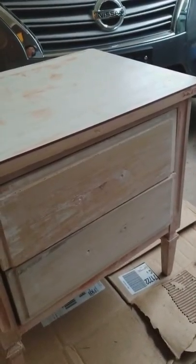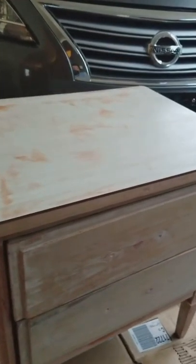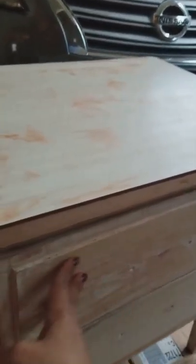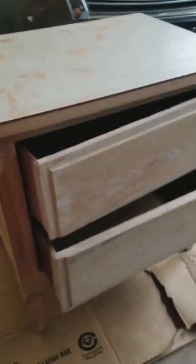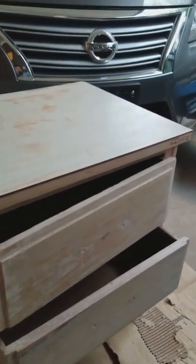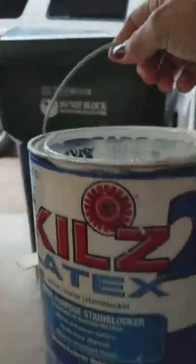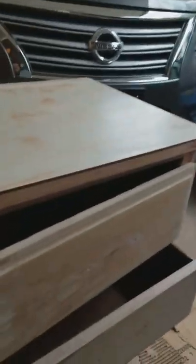This is my cabinet and it's all clean sanded now. I went ahead and did the drawers and they're completely clean sanded down. I washed it down with water and everything. I'm going to use the Kilz right here to go ahead and put the primer on.